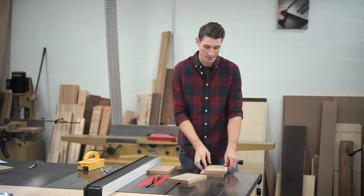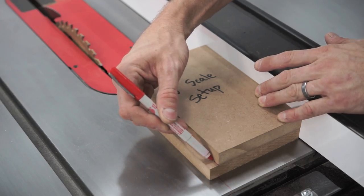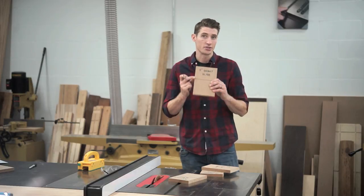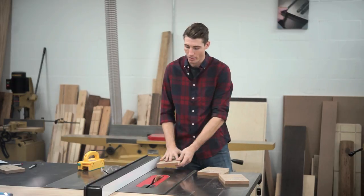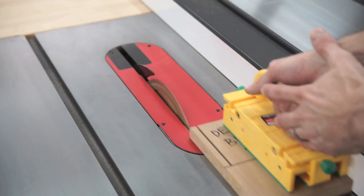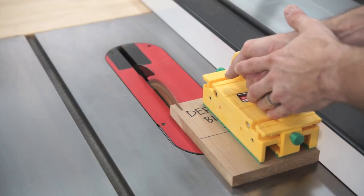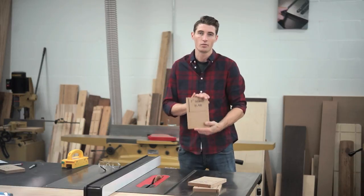Take the boards that have the line down the middle, put them on the table and up against the fence, then take your scale setup board and put it on top. We know that that's 5 inches, so we're just going to register off of that. Trace a line at the bottom of the scale setup board — this thin line is our zero cut line, that's where we want to end up. Next we're going to rip these boards halfway up to that line and then stop and pull it back. What we're doing is cutting a portion of the board with our default blade so that we can see our zero cut line, and as we change blades and cut the rest of the way, we can see and measure the difference between the two blades and know how many arbor shims we need.